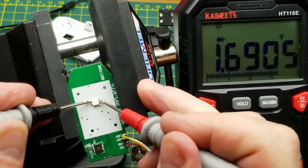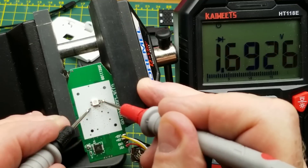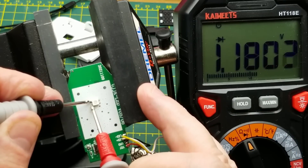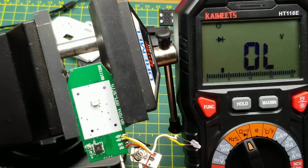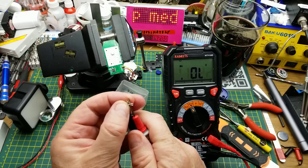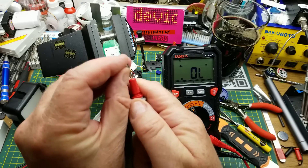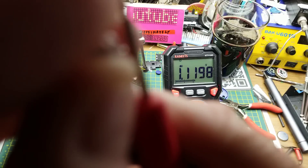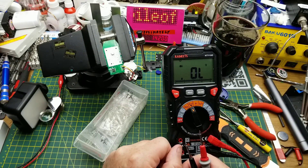The red LED has a 1.7 volt forward voltage. And there's another diode with a 1.2 volt drop - could that be what an infrared LED looks like? Let's check a random infrared LED for comparison - yeah, 1.12 volts. So it seems to confirm there's an infrared LED in there. Can this camera see infrared? Bringing it right up to the sensor - no, it doesn't look like it can. So there is actually an infrared LED in there, I just can't see it with my regular cameras.